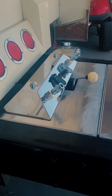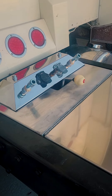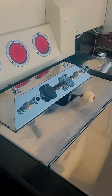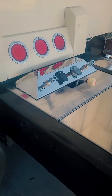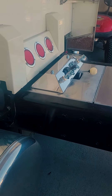The reason that's there is you can take those two bolts loose. We left a loop of airline and electric line underneath there so it can be slid out of the way just enough that you can reach down through that same hole with a funnel and fill the hydraulic reservoir. So we tried to make a hidden but fairly easy access way for him to do that.